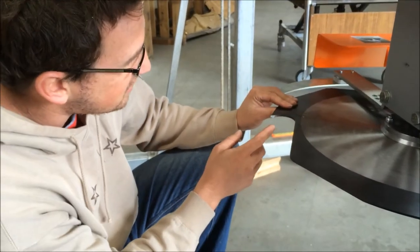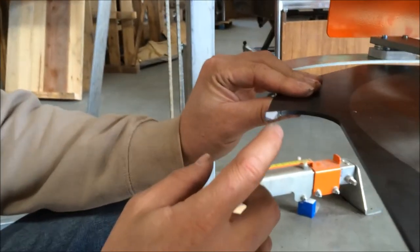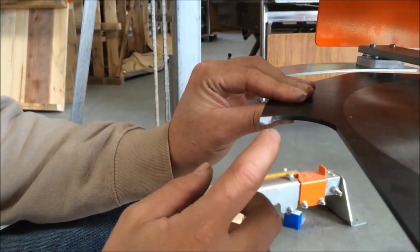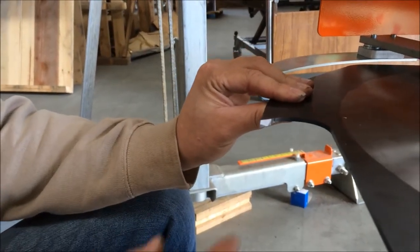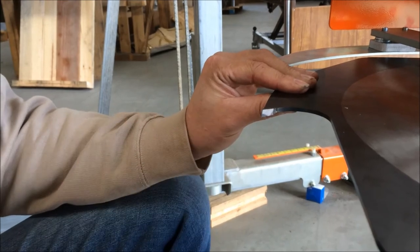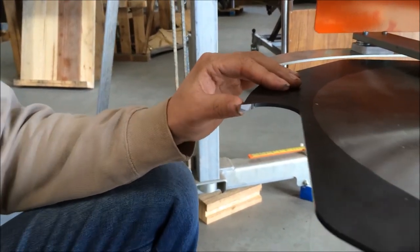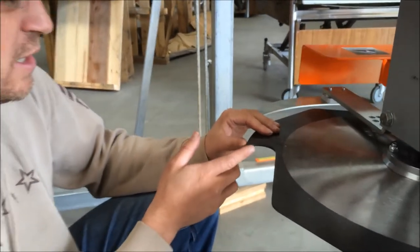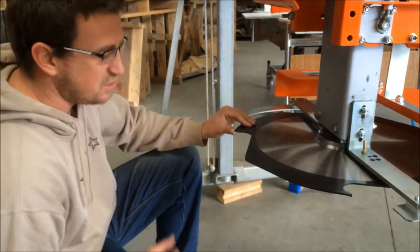Simple as that. I've just sharpened this face and you'll note that a good portion of it's shiny and a small portion of it's still black. That tells me I haven't sharpened it right — that full face needs to be shiny. When you sharpen the blade for the first time it'll take a little bit longer, because you're trying to match the face of the tooth. You're grinding it back so that it matches the face of your diamond wheel.